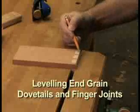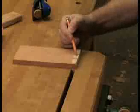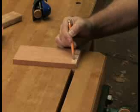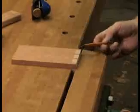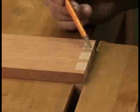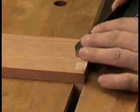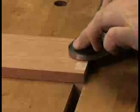I'm going to start cutting these tails. I'll just put a little pencil there so maybe you can see a little better what is happening. Now over here in this corner, before I was cutting this corner, I was doing this counterclockwise circular cut. Technically it doesn't matter on this whether I go in a circle either way or even just straight with a skew cut, because this wood is surrounded on 3 sides by other wood, so it's not going to break off like here. Okay, so I have different choices on this. Maybe I'll just start trying it, holding it on a skewed angle and just going straight ahead.